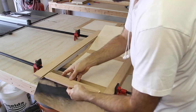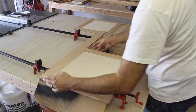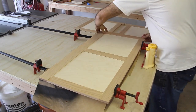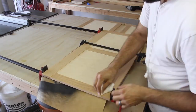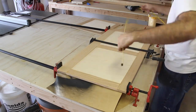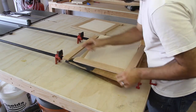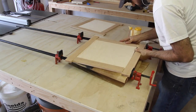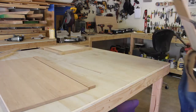Before gluing anything together I assembled all the panels dry just to make sure everything fit. If you just glue straight away you run the risk of something not fitting the way that it should. Everything fit properly so I started gluing up the panels. I assembled the panel on top of the clamps that would squeeze it together. There is a little bit of working time with normal wood glue but it's good to work quickly so the glue doesn't start to set up before the piece is secured in the clamps. I cleaned up the excess glue and measured from corner to corner to make sure the panel was square.